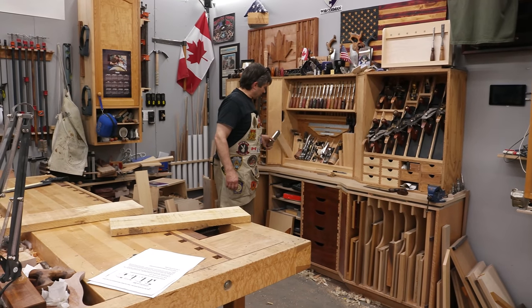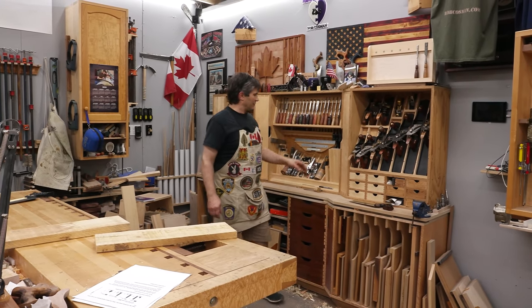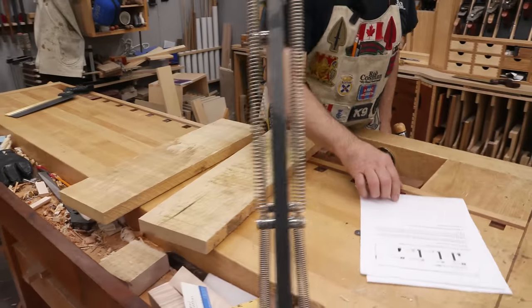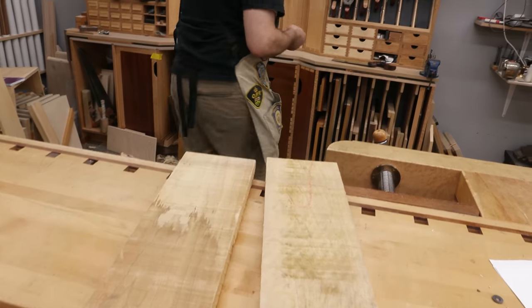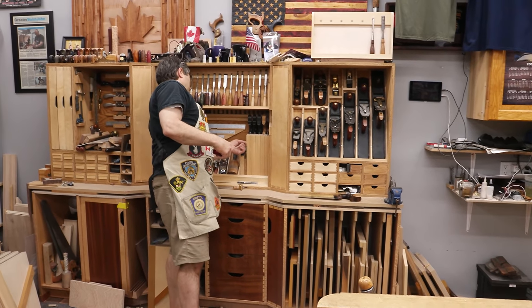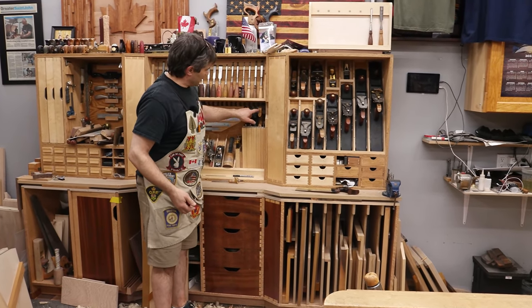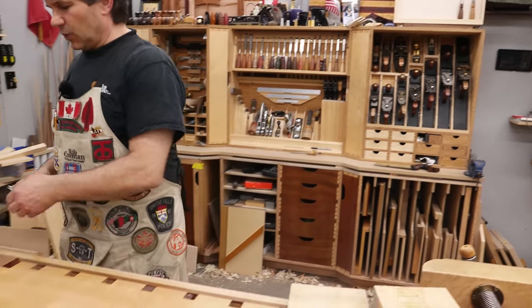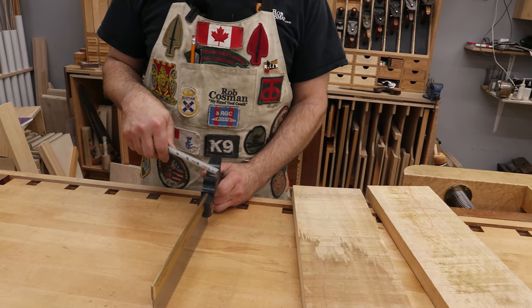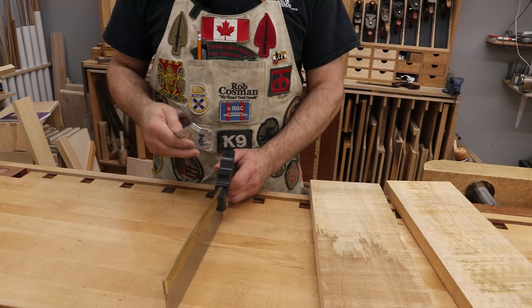This one actually broke where I have my squares because the wood simply wasn't strong enough. So I'm going to use poplar — you could use any hardwood. I need to mill these up to the dimensions I want: 12 inches in length, four and a half inches in width, wide enough so there's a little bit of space between each of the handles. My handle is an inch wide, so the blocks need to be at least an inch, preferably a little bit more — I'd suggest a sixteenth of an inch on either side, giving you an eighth of an inch between them.